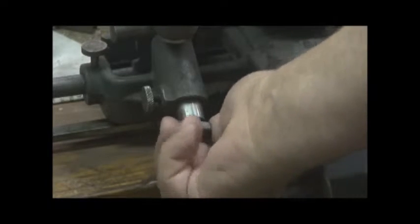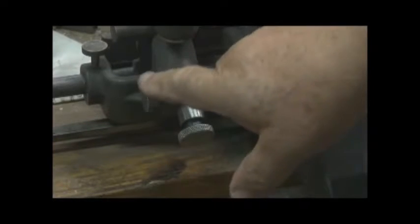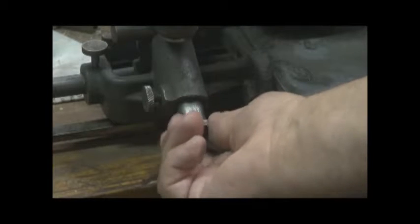This is your depth adjustment that brings your drill bit into the wheel. This is the lock for the cylinder, and you'll see that once I do this, the cylinder pad pops down. And then once you get to your final depth, locking this locks the barrel. Now the next time you come in after you rotate the bit, you stop on the barrel. Very unique machine. If you ever get a chance to get your hands on one, I highly recommend it.